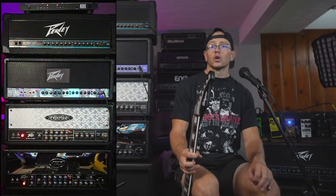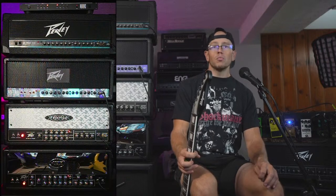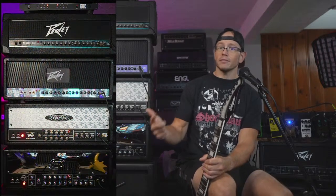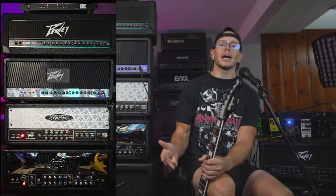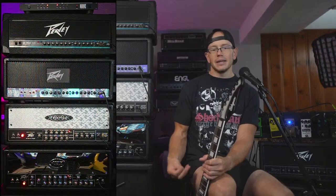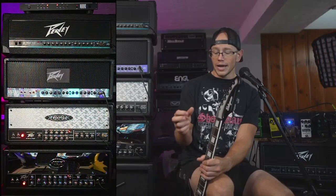As for Gold Lion, Gold Lion are the absolute worst tubes I have ever used in my life. Every single Gold Lion tube I have ever used has gone bad. That goes for their power tubes, and that goes for their preamp tubes. Every single Gold Lion 12AX7 I have in my stash, I have like seven of them, all microphonic. I have two different sets of KT77 Gold Lion power tubes, and in both of them one of the tubes is bad, and they have low hours on them. So maybe I am just getting absolutely horrible luck with the Gold Lion stuff, but I will never pay the premium for Gold Lion to begin with, and my experience with them has been nothing but awful.